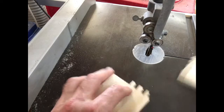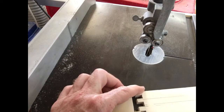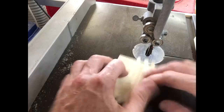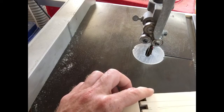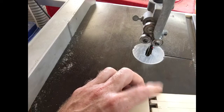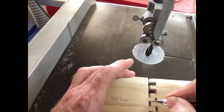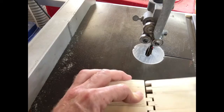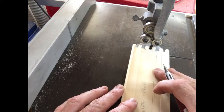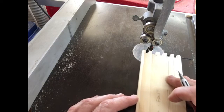I was thinking before about how I wasn't able to have the joint go in straight away — who doesn't want it to come off the saw and fit perfectly together? But in reflection, I would much rather have it too tight and have to shave off a little bit more to get it to fit perfectly, than to have it too loose to start with and have to fill it up with putty, which is going to be ugly. So this is not a bad result. Another thing you want to know: you do not want to force this together. If it doesn't go in firmly by hand, you may end up splitting the wood. So you just look for which is the next bit that's tight, and shave off a tiny bit more off those ones. Just to emphasize — you don't want to shave off too much, or you're going to end up with loose joints.